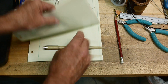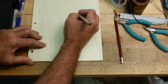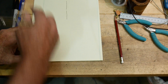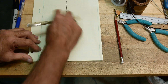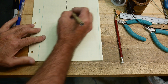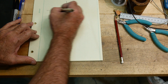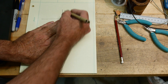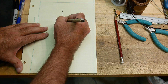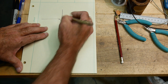Let's talk about a really simple antenna. We talked about dipoles, so let's go to the very next one — a vertical antenna. If you have a dipole antenna oriented vertically, you could feed it with a coax. What they do instead of making the other side of the antenna is put in a reflector and say, 'We're only going to put in this part.' So the coax comes in and we connect the outer shield to the ground radials and the center conductor to the vertical element.